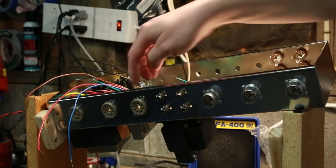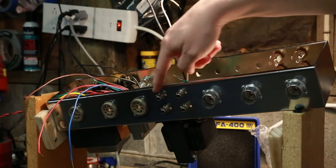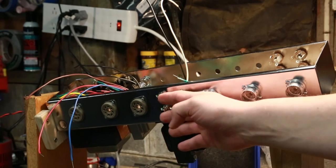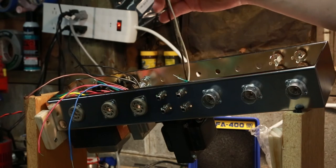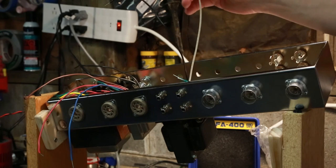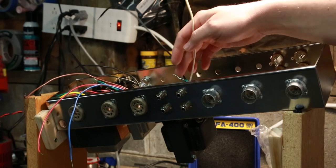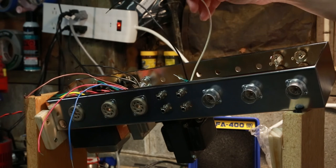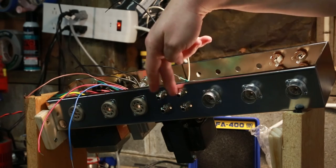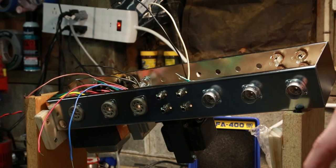I've got my preamp sockets, my power sockets, my rectifier socket, and the RCA jacks that are for the output. This is another thing that's a little different on the Bassman. Generally black will be the common ground connection, and then white, green, and green with yellow stripe will be different impedance levels. This one, if I remember right, is the two-ohm tap, and that's what I'm going to use because it's going to be four eight-ohm speakers in parallel, which gives you two ohms.